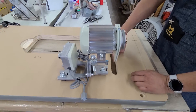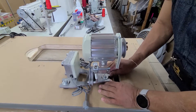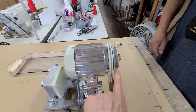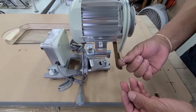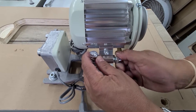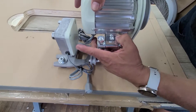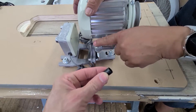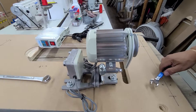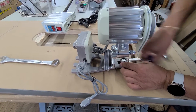So now we have to line the pulley. That's why we wanted you to leave these things loose, so we could slide this over a little bit. Now that we've lined the pulley up, we're lining the pulley up with the hole on the table. This is just a cover — you may not even need this little piece. You don't technically need it; it's going to go over the top of this and it's not really necessary. So now we've aligned it and we're going to tighten these nuts with a 14 millimeter wrench. Use the pliers, whatever you've got.